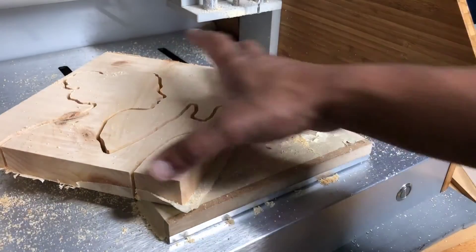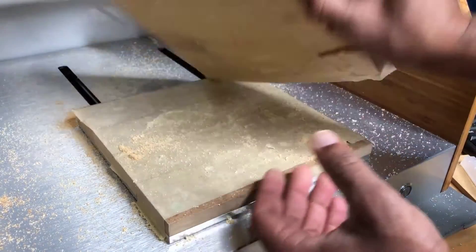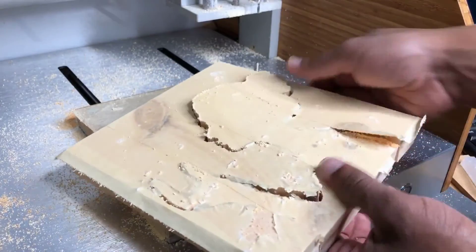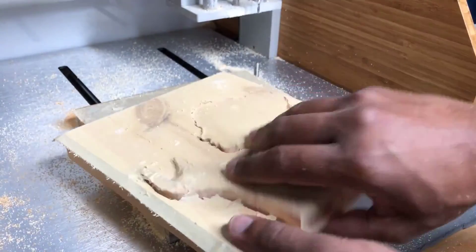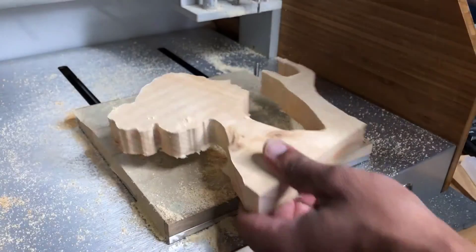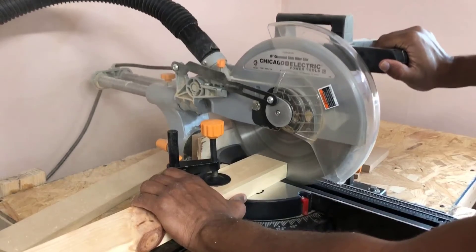After the 2D contour operation it was time to remove the part — and here's the beauty of using the CA glue method. It's really easy to pry apart. I simply used one of these palette knives I use for removing my 3D printed parts, pried it underneath, and the part just popped out. You know you have a good cut when all that's left is just the tape you have to rip apart.